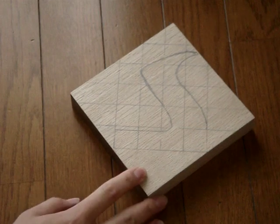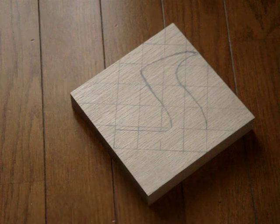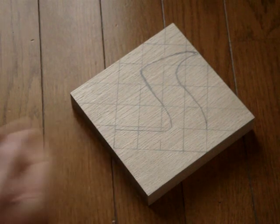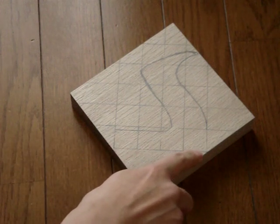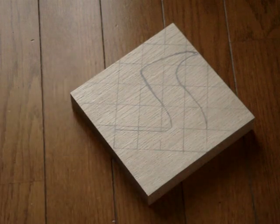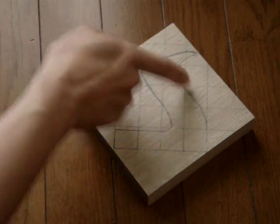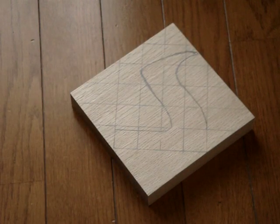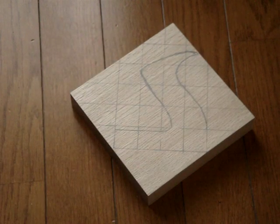Usually plane totes are a lot thinner in stock, so maybe 24.5 millimeters thick. I chose 27 because I like a chunkier grip, and I can always shave it down later if I need to. So to cut this out, I'll just be sawing to these three lines here, planing them nice and flat, so all square to each other, and then I'll be drilling a series of holes around here, and then connecting them up with a coping saw to cut that out, and then we'll be doing some shaping later. But I'll get the whole tote cut out first, and then I'll come back and show you.